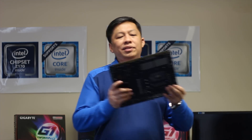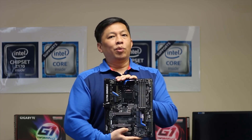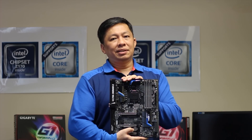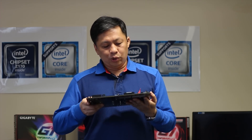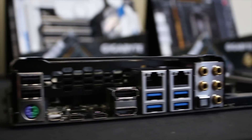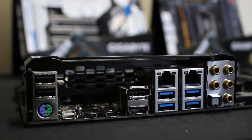On the second product in the Designer series, this one uses the Z170 chipset — it's the Z170X Designer. It follows the same concept from the X99. We support DisplayPort input here with a mini DisplayPort, and it comes with two USB Type-C ports — one to connect to a monitor, the other to connect to other Thunderbolt devices. No problem at all.